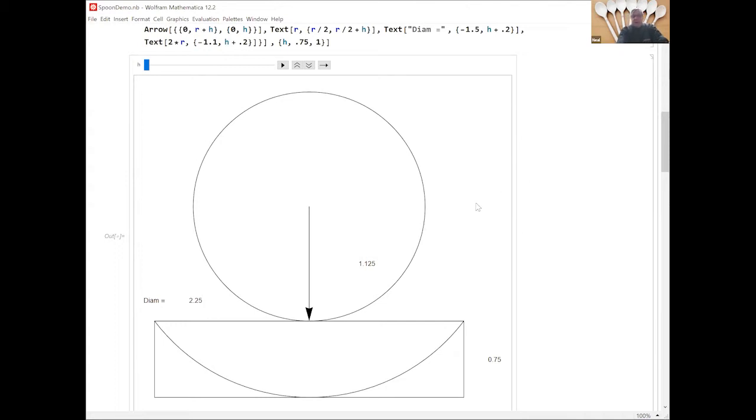And really, what I could have done when I made my wooden jig, remember, I made it so it came just tangent with the bevel extension. I could have made a little, like 1/8 inch gap or so there, and made it a little bit wider, and I would have had a little bit more space to hollow. But I find that 1.5 inches is fine. That's plenty.